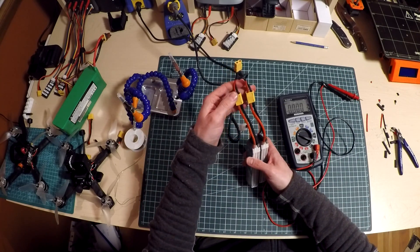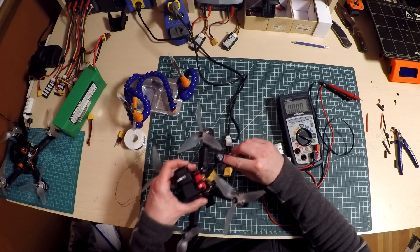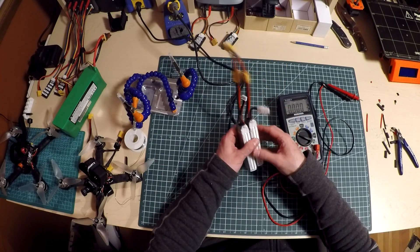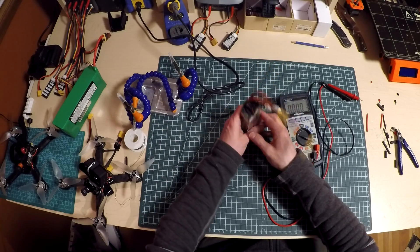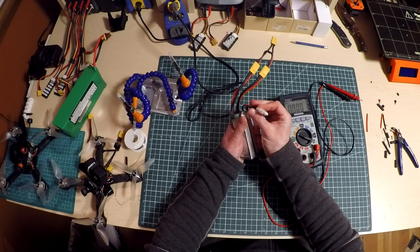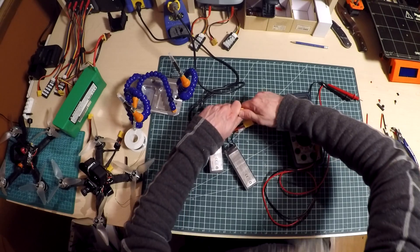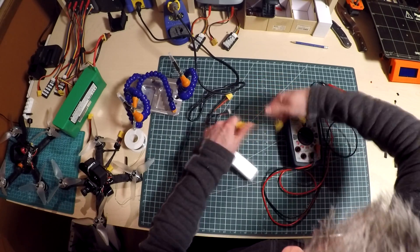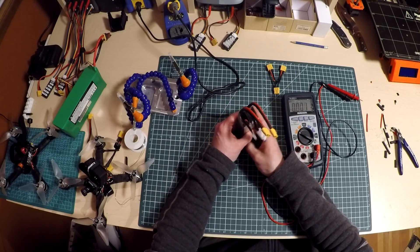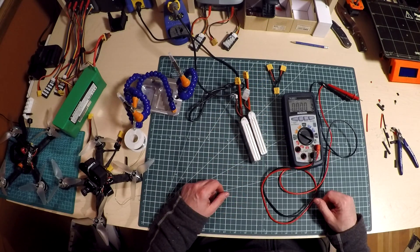The way this will hook up is it will go on the bottom of my quad and plug into the XT60 connector. We'll have a little bit of extra wire, but that's okay. Now, how do we charge this thing? I'm going to tape this together. I've got two balance plugs — I take the connector off and just charge the batteries separately. As long as the voltage of these is almost exactly the same, it shouldn't be a problem. Tomorrow, we fly it.